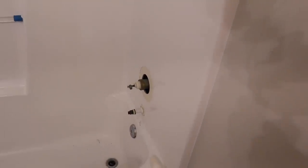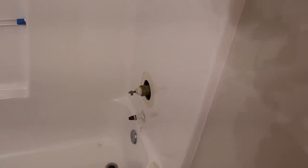That's what I'm thinking. Anyways, I'm still fighting this faucet set. Not even the handle giving me problems right this second. It's the slow drip and trying to figure out how to stop that, and there don't really seem to be no good way to do so. Hypothetically, if I was to replace this whole diverter, which it could call for doing to stop that slow drip, I'm kind of at a crossroads. In order to replace the diverter, I would have to literally cut through right back there. And that would just be so fun. But I'm gonna try to avoid that at all cost.